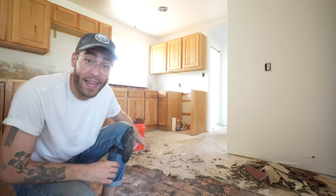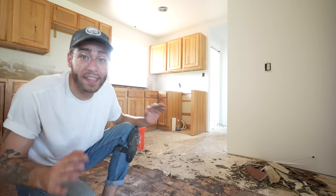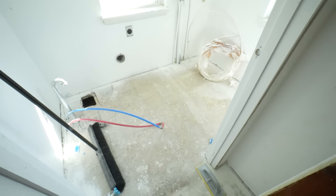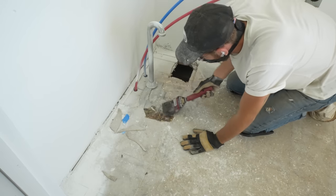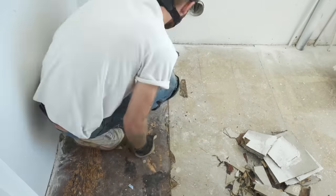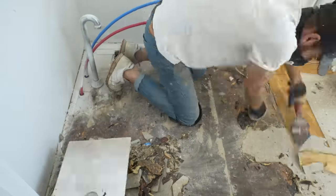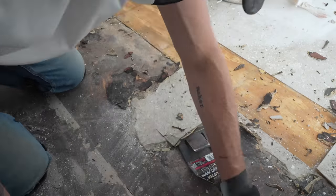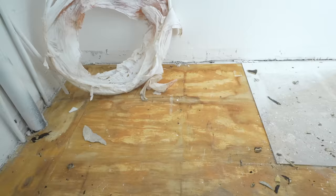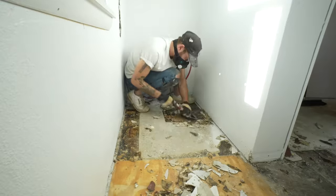Progress has completely stopped. This edge on the floor is just glued down too well. I'm starting to think I'm going to have to rent a power scraper, but before I concede to that, I'm going to start scraping back in the small bathroom where I know some of that tile is already loose, and see how far I can get. I had a plumber replace the galvanized pipes under the house with new PEX lines, and this gave me a good place to start peeling from. The flooring's coming up really good in here. I'll be sure to repair the hole in the subfloor in the kitchen before I put down any new flooring. I've still got quite a bit to do in this small bathroom — after the new flooring's down, I'm going to do a shower install, a new corner toilet, and hopefully a custom built-out vanity. This is where the toilet used to be, and it's going to be the new shower.